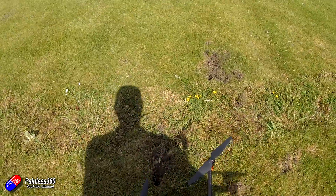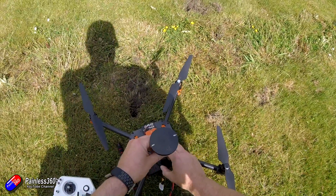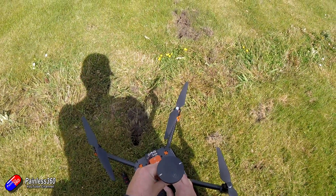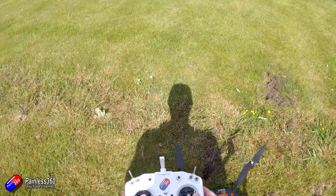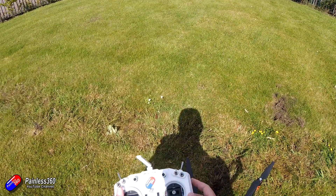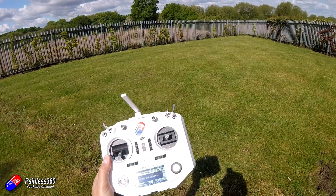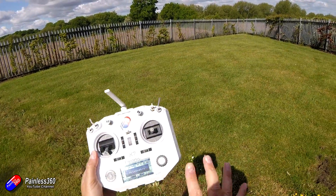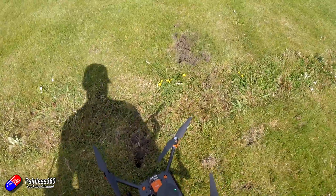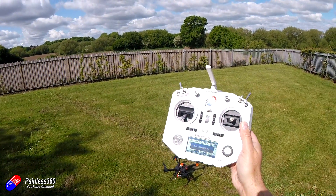Here we are at the field, a pretty quiet day. I'm going to use this hole as the kind of marker for the home location. I'm going to have to set up the GPS and turn on the radio. We're going to start in stabilize mode just to make sure the basic flight is all working, and then we're going to build on all of those. I'm using the Yapu script on here — I'll put a link in the description so you can see how to set it up. This will show me when 3D lock and things are all there. So plug the GPS and the Pixhawk in and we're waiting for the initialization to be complete.